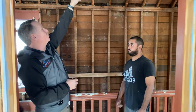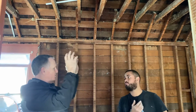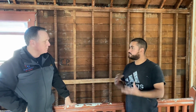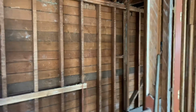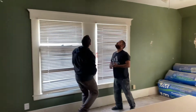So, on this one, we're going to have the duct here. So I noticed that there's no mastic on here. So you're going to get up here and seal this. Correct. And then once that duct's connected, there's no movement. Movement, correct. Okay, great. That way I don't break any of the sealing in there, and then we create a leak. And as I talked to you about, I can show you something really quick. If you look inside the boot, you're going to see those elbows have mastic inside.